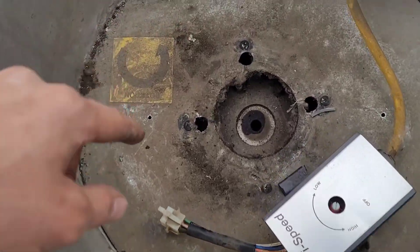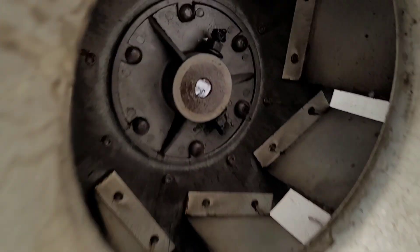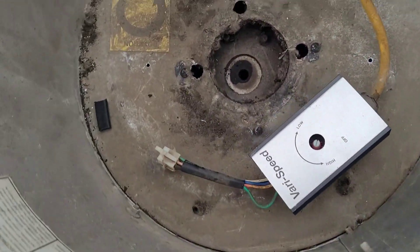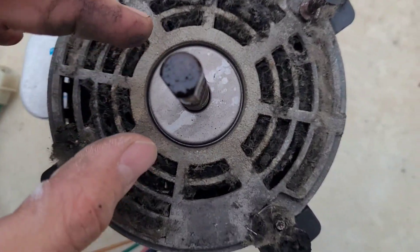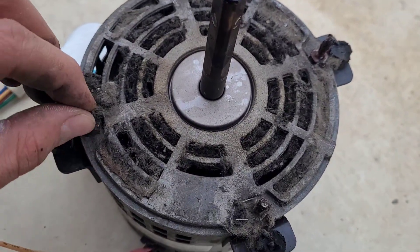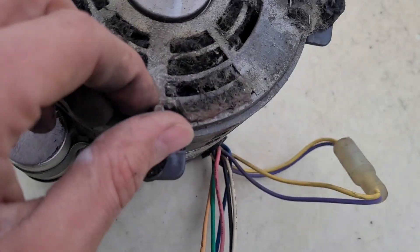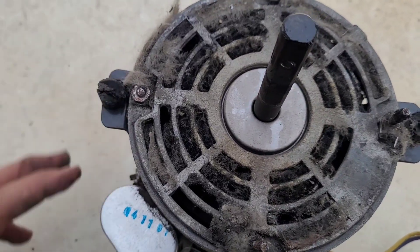I got the motor pulled out. In order to do that, just loosen the set screws, loosen the two nuts, and then loosen the two set screws in that order. Then once you get up into here, you can pull the motor. They have this strange shaft layout with the angled cuts. We can see these motor bolts actually help keep the motor from escaping — see how close to cut off this is? There's hardly anything holding it.